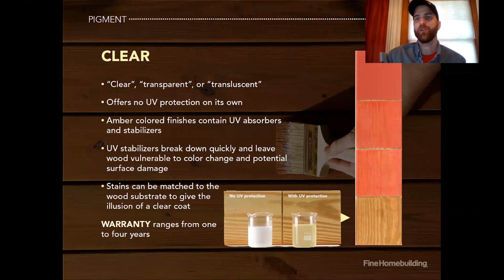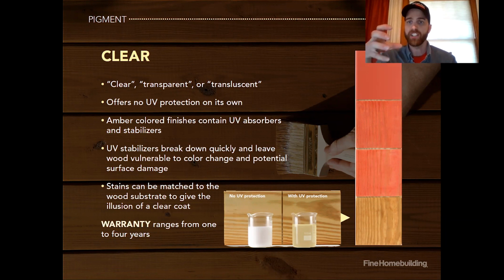Do larger stones under a deck create the same capillary break as gravel? Larger stones, yes, they should, like I said, as long as it's moving from small to large. When you say larger stones, the only thing I worry about is if it's larger stones with a lot of small stones in between them, like you would have with a concrete mix, then no, it's not going to help you. If you had sand, then 3/4 inch gravel, or just dirt, and then 1 inch or 2 inch stones in a big thick pile, then yes, that's going to work the same way that gravel would.